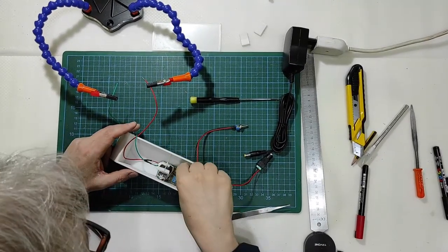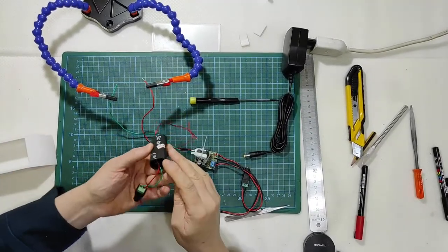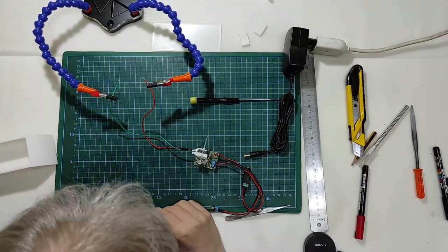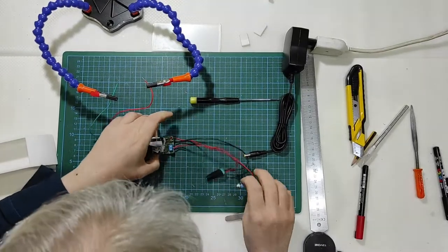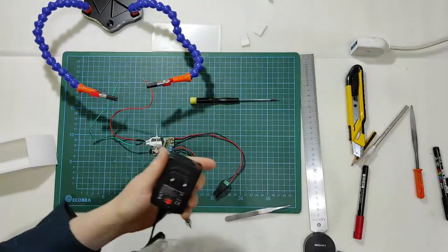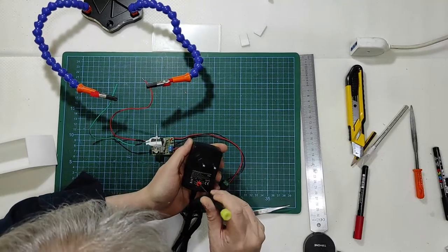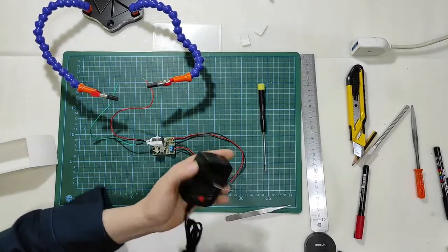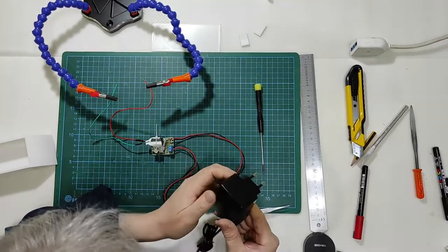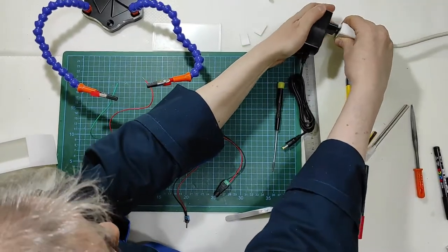Okay, so this is more loud because this is completely sealed with some hot glue and then some plastic, so this is less loud, less noisy. So this one needs just 3 volts. Let me switch back to 3 volts. Okay, and this is a 3 amperes AC adapter. It only needs one and a half amperes.